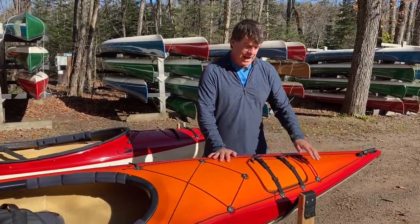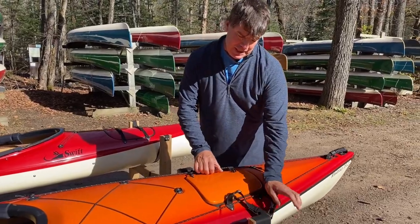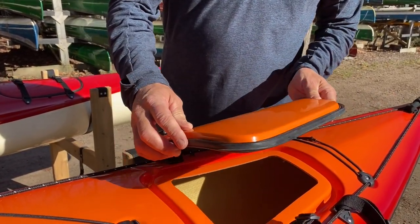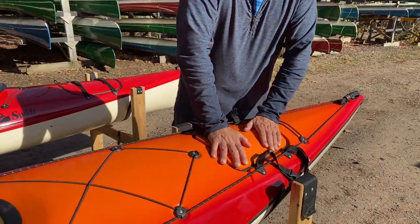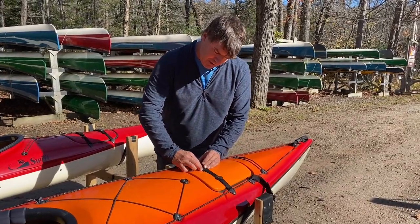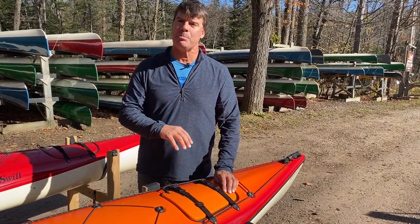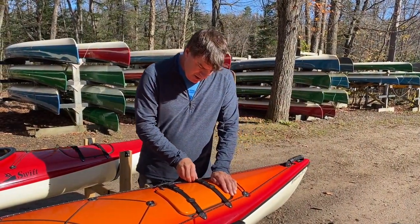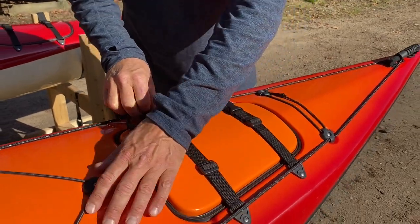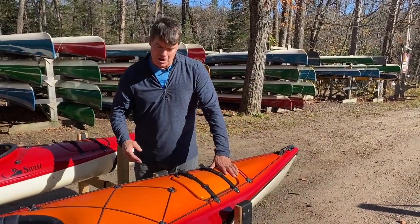Now let's talk about the hatches. Many of our boats have solid bulkheads and hatches on them, and all of the hatches have these straps. There's a rubber gasket — it's actually a car door gasket with a channel that you just put right down on. No hatch is 100% waterproof; you can get small drops of water in. These are pretty water resistant. Put everything in a plastic bag or rubber bag. If you want a tighter seal, push down on the end and crank the straps a little bit tighter on both sides — gives a snugger fit if you're really going out on a longer trip.